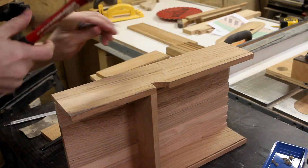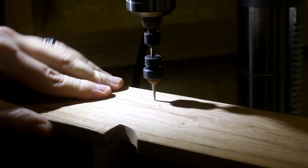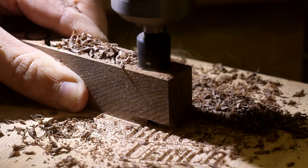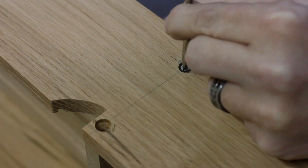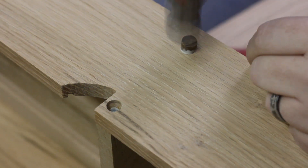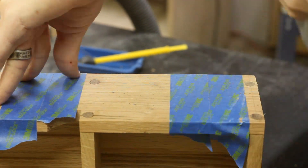At this point, I'd like to add some screws for reinforcement. Plus, I thought it would be a good opportunity to use my plug cutting set. I start by marking exactly where the holes need to be drilled and heading over to the drill press. I drill out all the locations, and then to offer some contrasting color, I cut some walnut plugs to fill the holes. And just because it drives everyone nuts, I used some flathead screws. I added a touch of glue to the plugs and then sent them home. Using some painter's tape, I spaced up my flush trim saw as I nipped off the plugs and then sanded everything perfectly smooth.